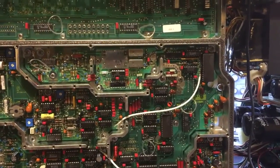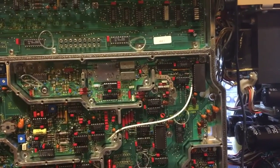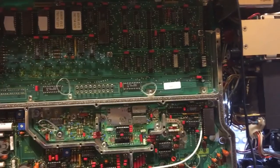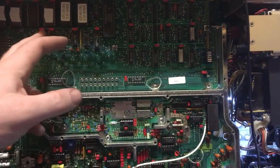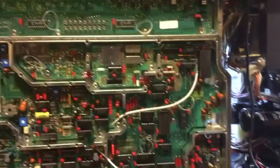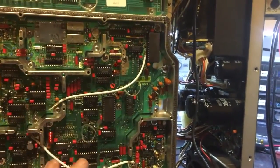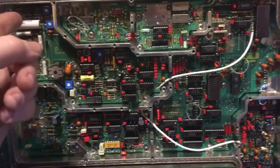It's sometimes 20 out, sometimes only 10, and other times absolutely bang on — and it seems to be around certain frequencies. I need to figure out what binary codes are going between the devices controlling the actual frequencies. Unfortunately the manual doesn't say enough about that — it describes the controller board but gives no detail on what binary codes are used to change frequencies. These are EPROMs storing calibration data, and there's the main CPU which is fairly warm.